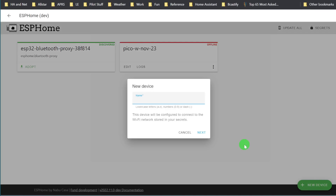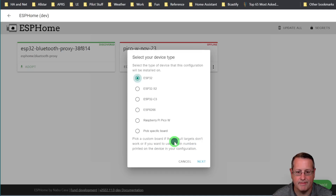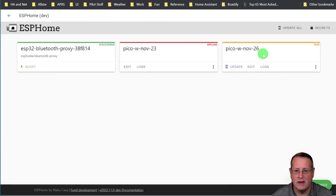This is a little bit different than what we normally do with ESP devices. Typically you'll install the ESP device all the way from front to back and just follow the steps. Here, we're going to skip a few steps. I've got one up here called PicoW November 23rd from when I was playing with this before. I'm going to do PicoW November 26th. Choose whatever name you want — name it wisely so it knows what it is on your network. Then click next. It's going to create the configuration and install it on your device, but you don't really want to do that — you want to skip that step. Then pick the board. In this case it's a Raspberry Pi PicoW. You pick the specific board, choosing the W or non-W version. It really doesn't make sense not to use the W, the wireless version, because this stuff is going to talk to Home Assistant over the Wi-Fi network. So choose that, click next, and skip this step as well. What it's done is created an entry in your ESPHome development dashboard.